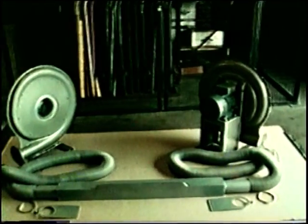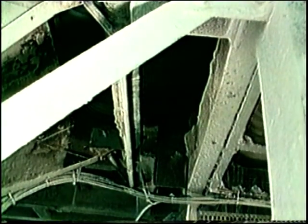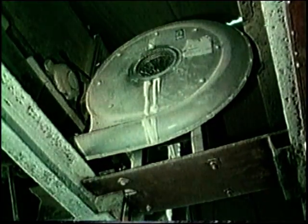Scrape Air is yet another new design, where nothing touches the belt. A controlled balance of air is directed at the belt, removing wet or sticky material buildup. This scraper is an independent unit which forces air through a slot, creating a band of high-velocity air across the width of the belt. Less horsepower is required than compressor-driven systems, and in most cases it can be adapted to perform well on chevron belts and sidewall belting.